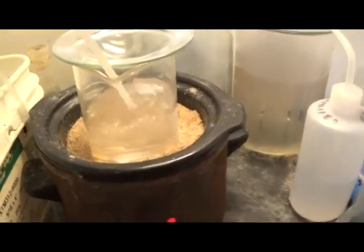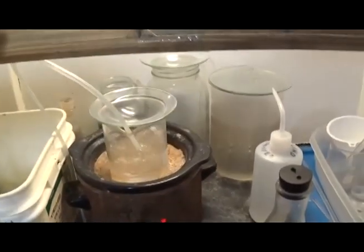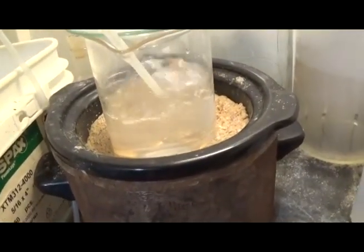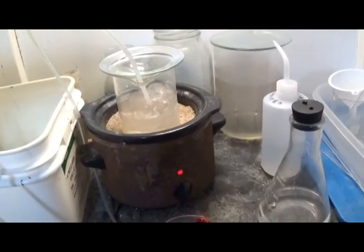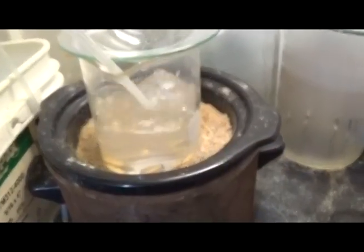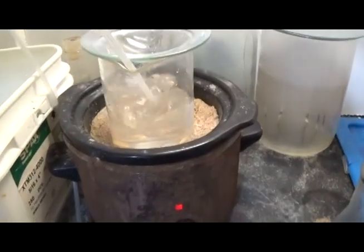We have it spinning and agitating. We'll add about 40 milliliters of store-bought hydrogen peroxide and then we wait. We'll check it from time to time. I'm hoping to see the solution turning blue-green fairly quickly, which would mean we're dissolving the base metals. I don't think we'll be dealing with any silver, but I'm going to use distilled water from here on out just in case there's some silver in this gold-filled material.